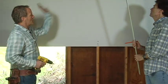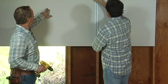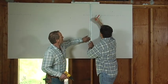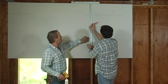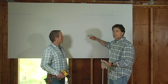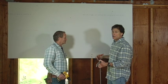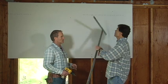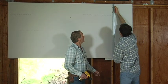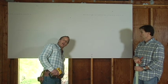How do we find where to put the rest of the screws? If you've got a really good eye, you can follow the marks on the sheetrock — those alignment marks will help you find the studs. Or you can snap a line, because if you have a line in front of you, you know exactly where to be and can space your screws correctly. If you're not tall enough to reach the top, start from the bottom and do the same thing. You basically want to line up with the center of the stud.